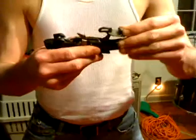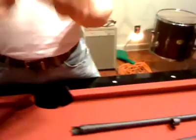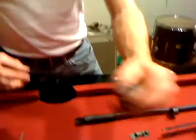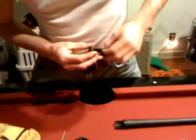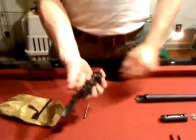So, the way this works, when you cock the weapon, this slides back and this fits around the hammer perfectly. See? So what happens, bolt carrier comes around the hammer and pushes it all the way back into the rear position. And what happens then is the hammer will lock once, it'll click once, and then totally lock back. It is now ready to fire. Then I would take the weapon off safety, as such, pull the trigger, watch closely. Hammer will fly forward, strike that button, like so. That will send the firing pin forward, like so, and hit the primer on the shell, igniting the powder and propelling the projectile down the barrel.